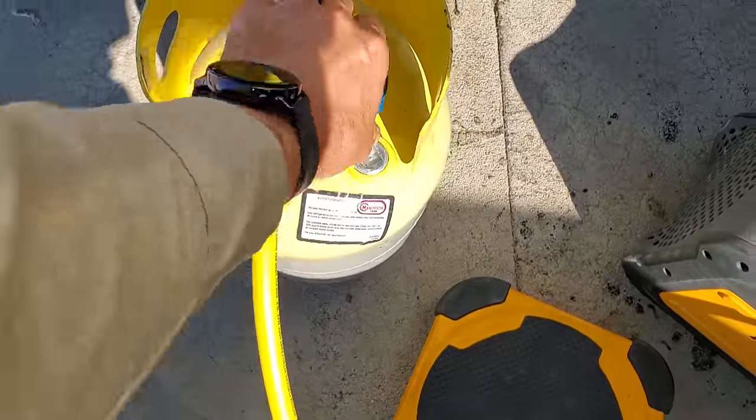What I'm doing is just blasting in the high side. I have the compressor terminal disconnected because everything else is still running. We're putting as much gas into the high side as we can. We're currently at 2 pounds right now. So we're just going to let it go like that, and then once it won't take any more into the high side, we'll switch it over, start the compressor up and charge it on the low side.